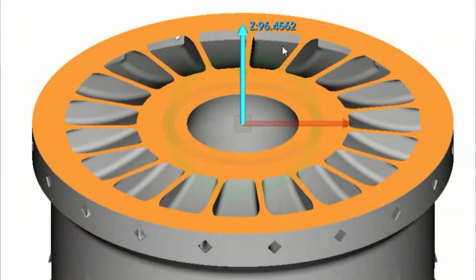Now, if you go back to that picture with the downskin and the shroud, where we are still building that wall, all we are doing is basically stacking cards on top of each other. And in this situation, we are actually increasing the bending stiffness. So that is not a problem. The residual stress is not strong enough now to warp these multiple layers of cards, this set of melted layers on top of each other.